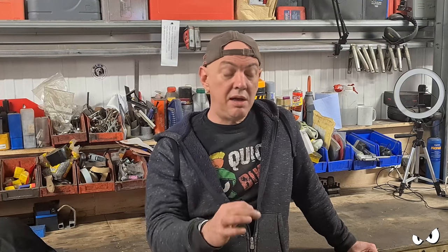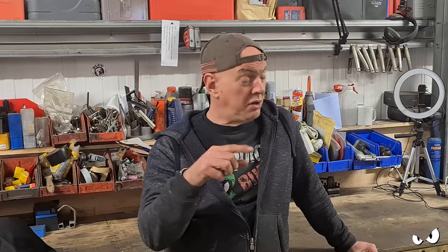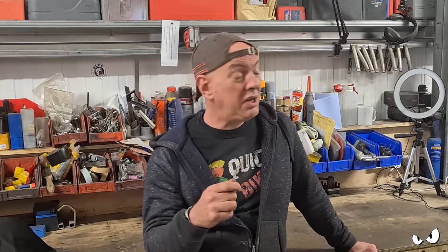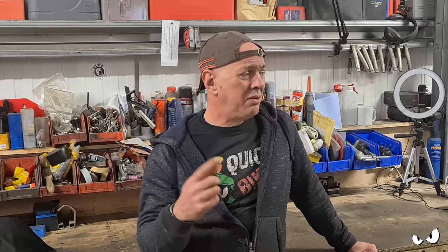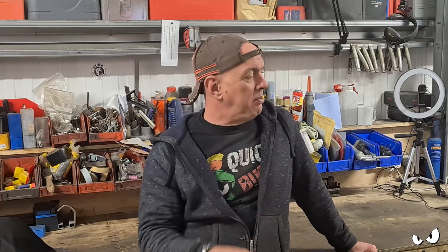And that's kind of the lowest point at which the speedo wants to sit. So as long as it's central to that, and I've got the angle right because I measured that, then that can be done off the bike at any point as well. So that's all fine. The mounting at the top of the rear shock is just going to be a machined piece of alloy. Can't do it yet because of lockdown. Matt's not been able to come out and put the reverse switch on the lathe, so I can't single cut the thread anyway. So that's going to have to wait until the mill's up and kicking. But again, I don't need the bike altogether for that.